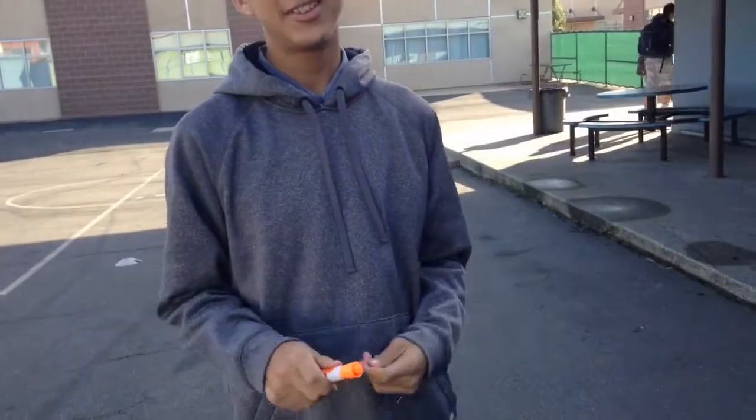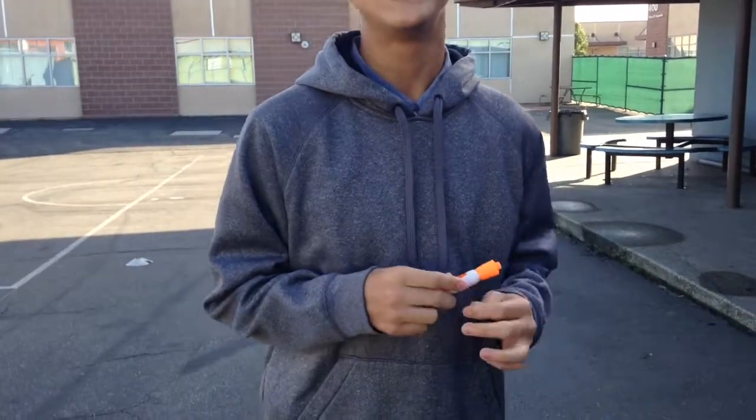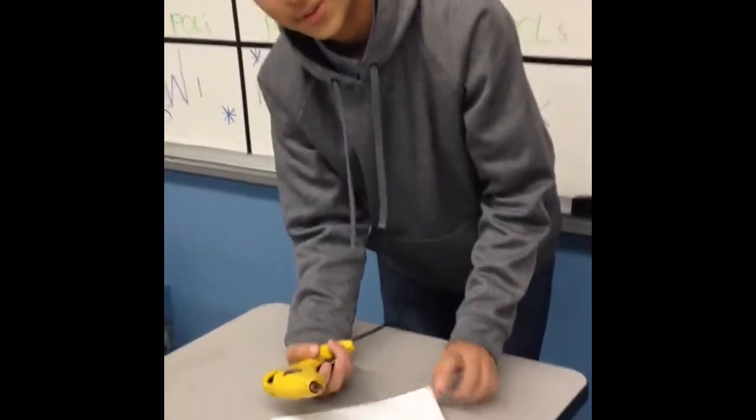A coil. You need to wrap the wire around the marker to have circular patterns. After that is done, you have to squish it together. There's two types of voice coils you can make. This one, which is homemade, and this one, which is more like the typical voice coil, which is made the same way, except with a thin paper for spacing between the magnets in the coil for more vibrating space. To make a coil, you will need a hot glue gun to secure loose parts.